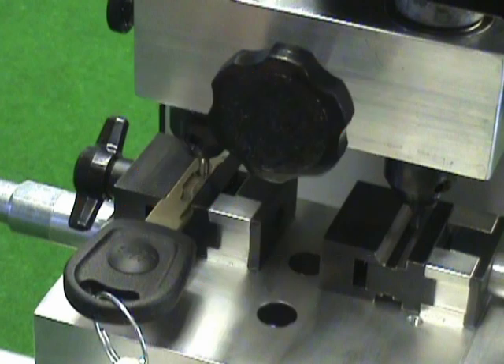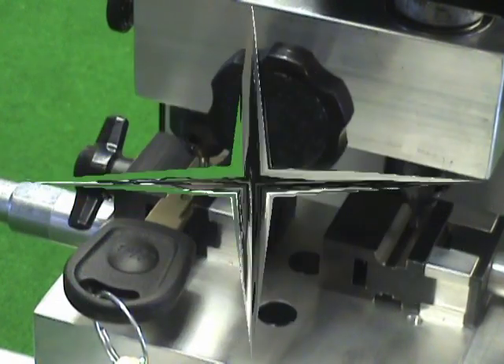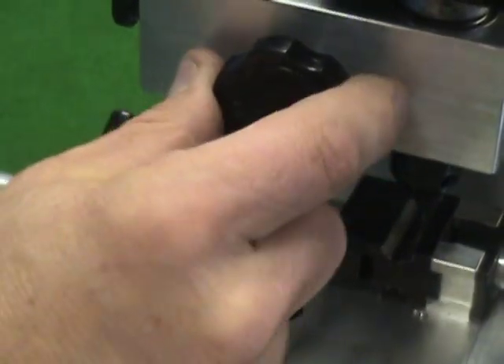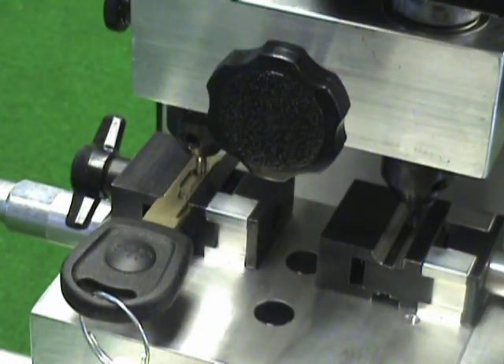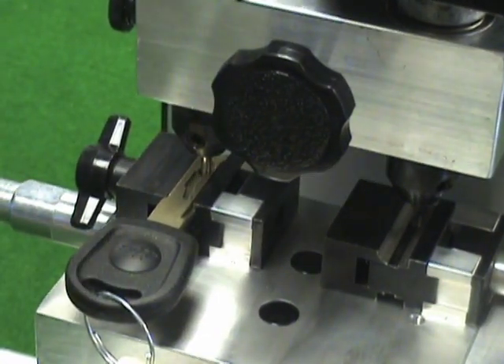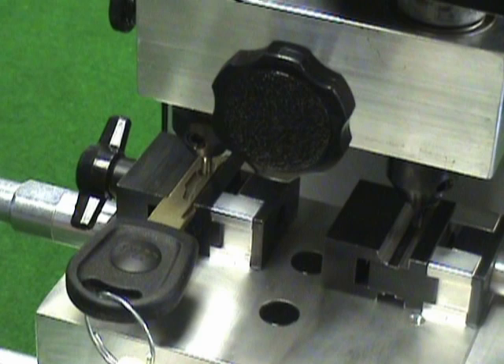Position the cut-out portion of the pattern key under the guide and pull down on the spindle lever until the guide contacts the key. Continue downward pressure until the guide shaft bottoms out and the downward movement of the spindle lever stops. Do not use excessive pressure. This step is critical — you must set the proper cut depth for this particular style of key. While maintaining pressure on the spindle lever, tighten the cutter head clamp nut to fix the cutting head in place. As a check, the cutter and guide should visually be at the same depth, the guide should have no up-down travel, the guide is pressing down on the pattern key, and smooth movement of the table would be difficult.